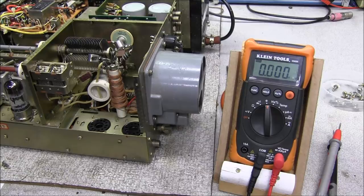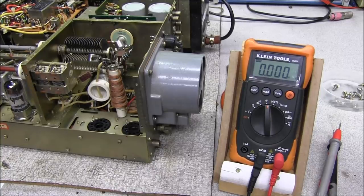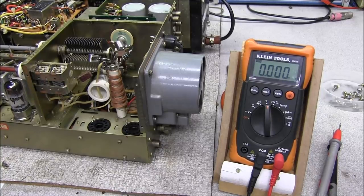I'm not going to change it. I'll put USA-made tubes back in it and we'll check it. If we can't get the neutralization to minimize in this rig, then we'll have to go back and change it. Honestly, over the years I've never really had a big problem — I think there was only one rig where I changed it to a 10 picofarad. The range of the neutralization capacitor is not that great anyway, only about 10 picofarad.